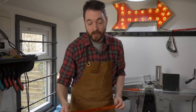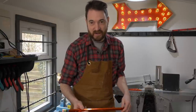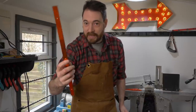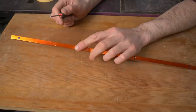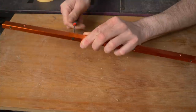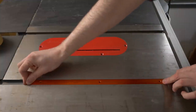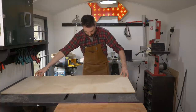When I've made sleds for tables in the past I've made my own hardwood runners. The trouble is with seasonal movement they expand and contract and can be tight or wobble a bit, so I've got some UJK aluminium ones from Axminster. What they have is little plastic grub screws that you can get a slotted screwdriver in and wind in and out to get the perfect fit in your mitre slots. I've got these adjusted so they fit in the slots with no wobble, then I can get the ply base of the sled put into place.